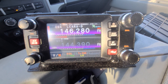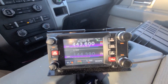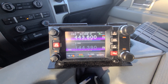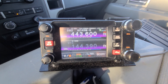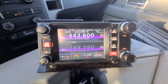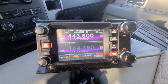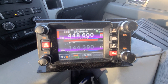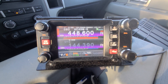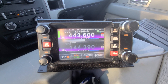Thanks for all your help. KK4YUG, this is KY4BDP Mobile. I've switched over to the 70-centimeter repeater, and hopefully we'll get at least the repeater ID coming back. This repeater is not used as often, but we do run it — it's a Yaesu repeater. Here in the middle of the roof, as we saw with the SWR checks, SWR for 440 was around the 1.4 to 1.5 range. KY4BDP Mobile, testing out a new antenna, wondering if anybody listening on this frequency can give me a signal report. The repeater ID comes back — we can see it's not coming back full scale, but it's still quite good.